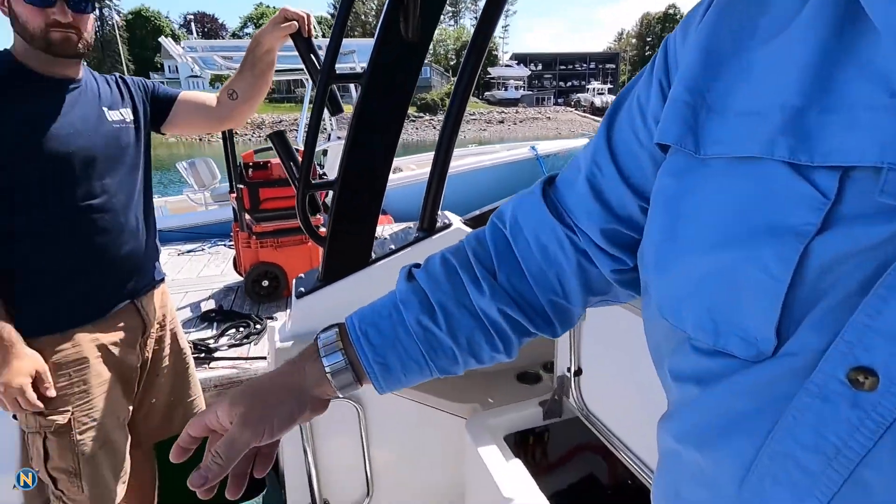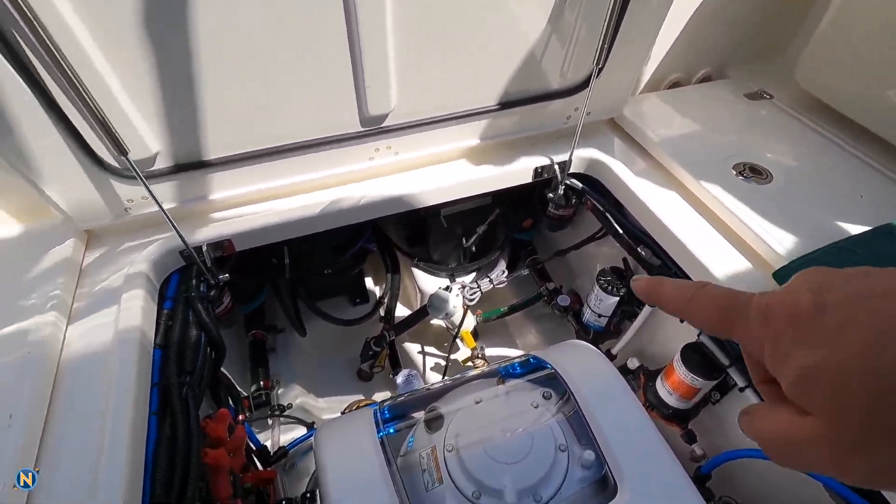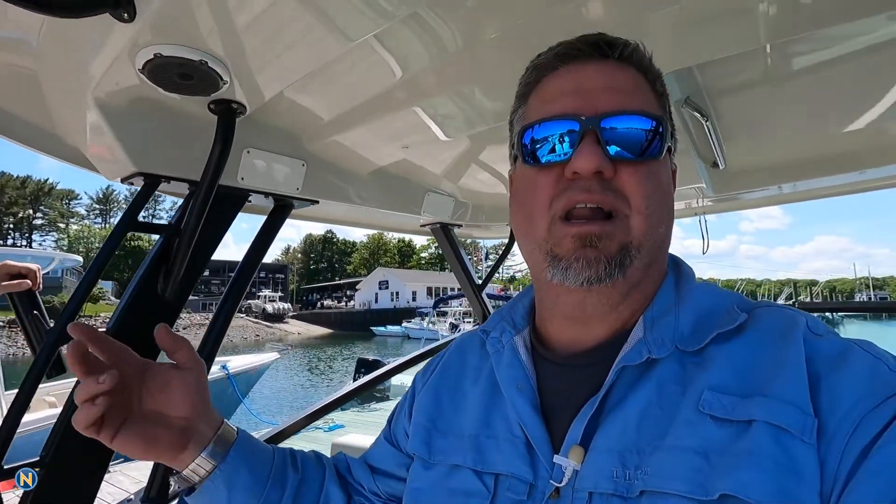This install is really sweet. This is not a factory option from Boston Whaler, so it took some planning, some forethought — power management. How do we make sure the cable size is the right size as we run our leads forward to the new battery location? We also went ahead and re-plumbed the pumps. Those were over here and they were on top of the electrical connections, which is just not a good thing. So we relocated those pumps to the other side — all the pumps on one side, electrical on the other. Keeps everything very clean and neat.